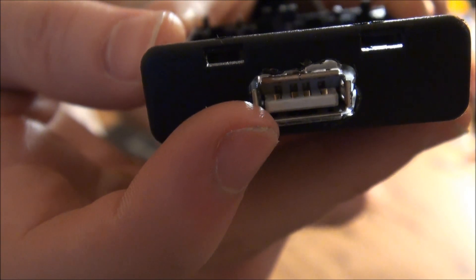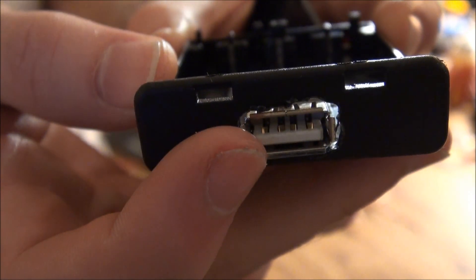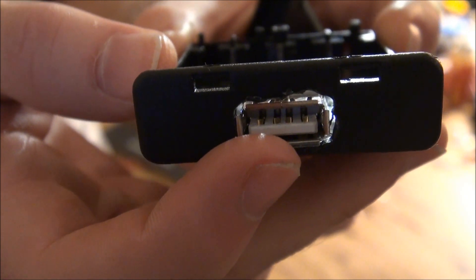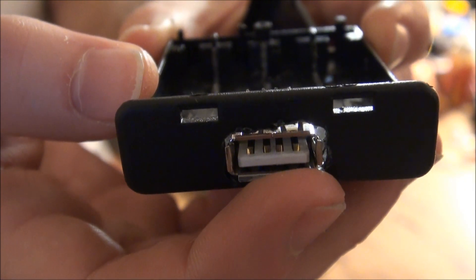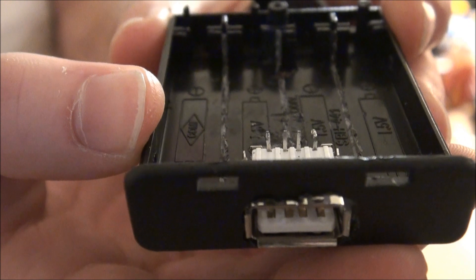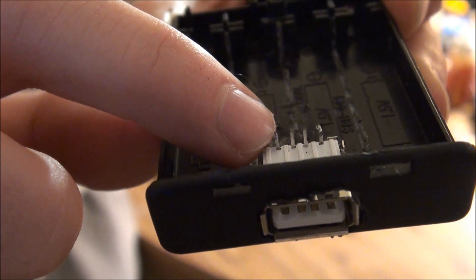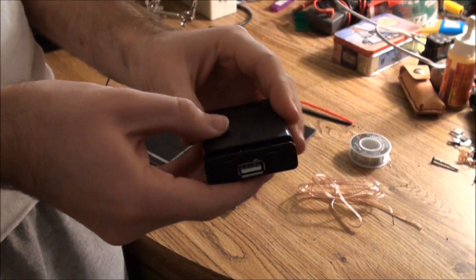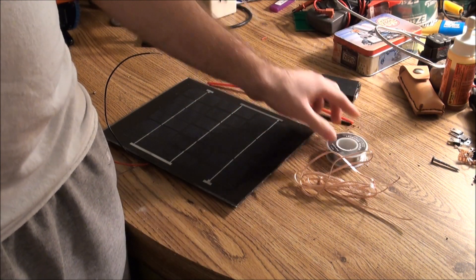So on your bottom left you can see there are four little prongs inside the female USB. Your bottom left one is going to be your ground — your negative. The middle two are just data, which you don't need to worry about because we're not transferring data, we're just transferring power. The one all the way on the right is where your 5 volts connects. You're also going to need some wire, some solder, and some heat shrink tubing.